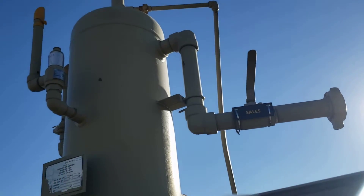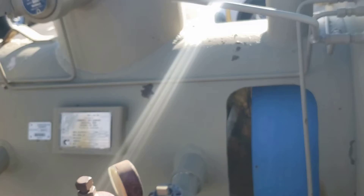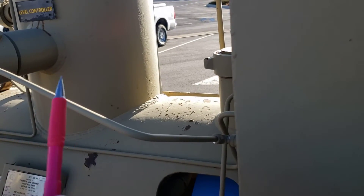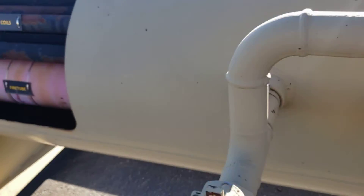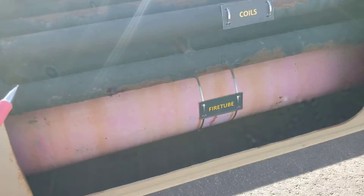Notice this one has a gas dome. Your gas sales outlet line would be that one right there coming off the top above the demister pad. Notice this communicating chamber does not have a flange attaching it to the main chamber — it's got just an ordinary welded connection. This one also has coils in it.